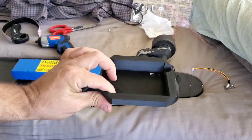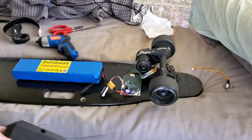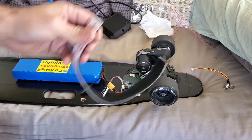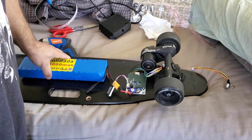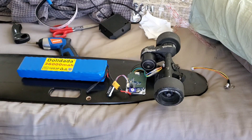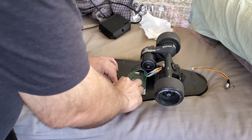Shoutouts to original Dobo — I've been waiting for a lot of parts to come in, but he 3D-printed this cover for me. I'll put a link to his YouTube channel because he was super cool and printed this so I can put it over the electronics. I just mounted the battery with locking velcro so it can stay on the board with no issues and won't fall off while you're riding. And there's your 36,000mAh battery — 36 volt, 10S 3P — pretty potent little battery, should get some pretty good range. I just had to solder on my own XT60 connector.